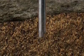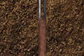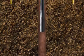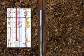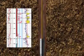In the first, the drill bit is replaced with a diamond-studded coring bit at the bottom of a core barrel. This can cut a complete section of the reservoir rock and return it to surface for detailed analysis. In the second stage, coring may be replaced or complemented by running a suite of geophysical logging tools, which are run on electric wire line. These are instruments that can measure the physical properties of the rocks as they pass slowly through the well bore.